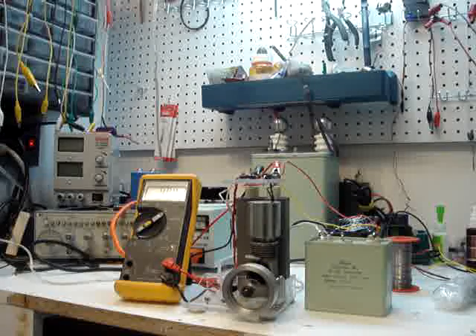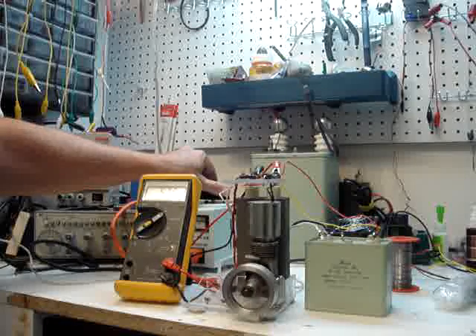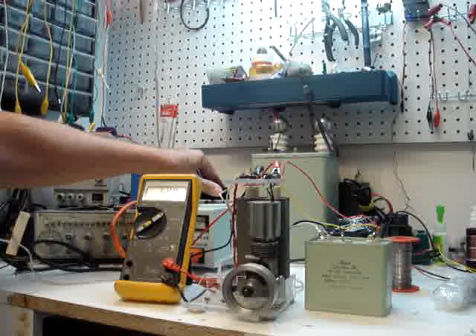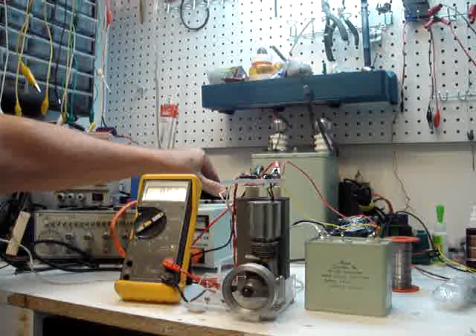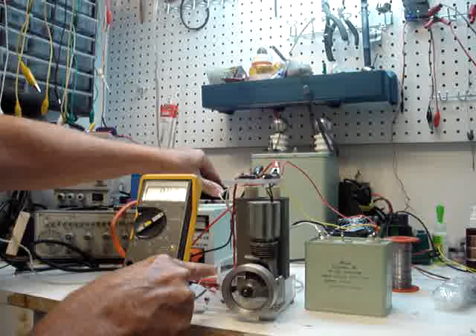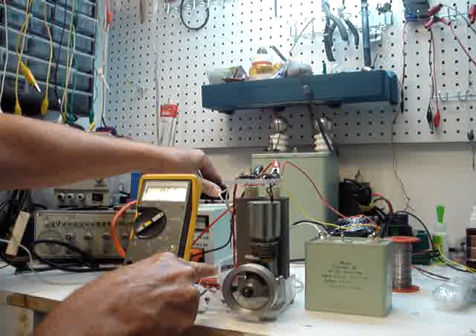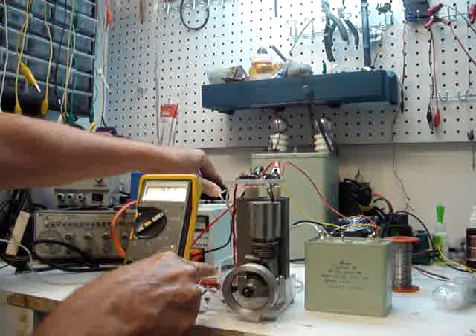The pulses are about 500 volts. It's a fun little motor. I believe it's the exact replica of the Gray system at the bottom end of what Gray was doing, because when you get up to 500 volts and come on up, the motor really starts kicking in. This motor is so out of balance because of the weight of the slug of the solenoid — I'm scared to run it above 1,000 volts. And at about 1,200 volts the solenoid wiring will start breaking down, which is incredible considering it's a 24-volt solenoid. So there's some sort of magnetic shielding going on in there that keeps the wires from breaking down, and I believe it's the solenoid construction.